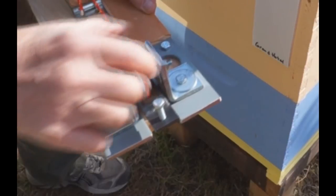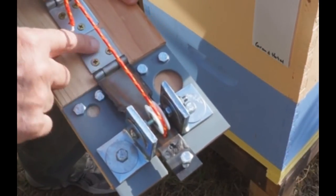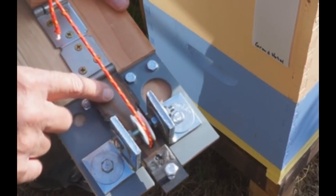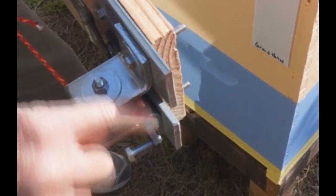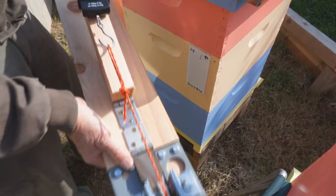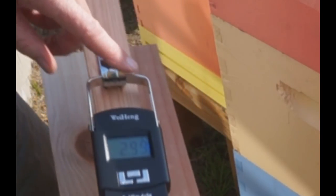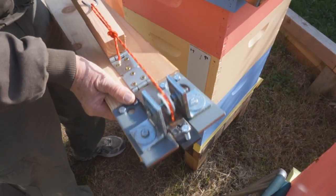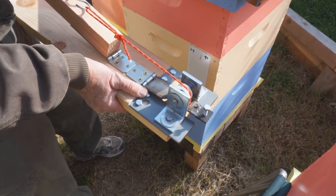Let's look at this a little better. What I have is two pieces of metal — two brackets with a bolt between them. This pulley I got from Orchard Supply. This is just a regular hinge, but I added a second piece of metal to it. If you get a sturdy hinge, you wouldn't need this. Since I have a welder, I added some extra metal, beefed it up, made it a little thicker, and put that bolt in so I can adjust the lifting height. This is all scrap wood and scrap hinges. This is an electrical strap for three-quarter inch conduit that I flattened out and made into a hook. The device doesn't have a whole lot of travel — you only need to lift it up a quarter inch or so, just enough to get it off the frame.